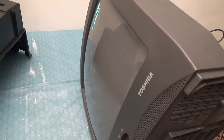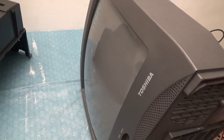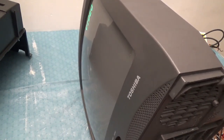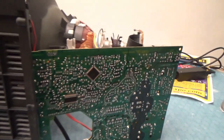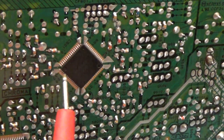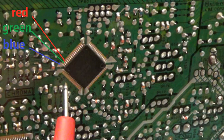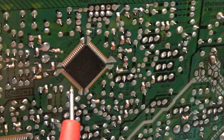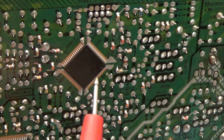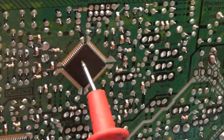See, I'm changing the color. I had it for a second — I had blue there. There's a cyan. So let's tap into that. The area I was probing around is on this big square chip, right around this area. This could still be the computer side, and that's just the outputs to the video chip. But either way I don't care, because I had a black screen in video mode and this produced color.